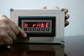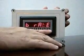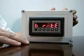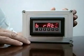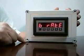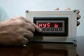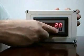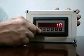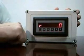I can now move on to the setup of the B relay. I'm also going to set up the B relay to follow rate. It has the selectable uses of total, pulse, and rate. On this model, only one of the relays can be used as a pulse output. So I'm going to be using the B relay for rate also. Such might be the case if you have a low flow rate alarm and a high flow rate alarm with your basic rate totalizer. There's a hysteresis available for it, and I'm going to set this one so that the hysteresis has a value of one. You're back to the run mode as indicated by the R in the far left-hand position.